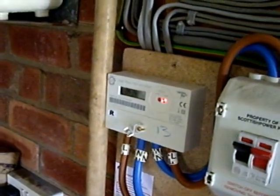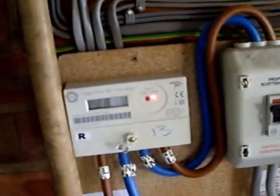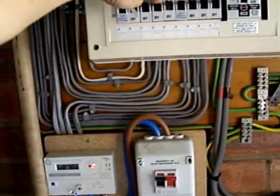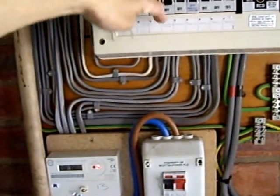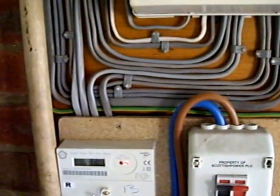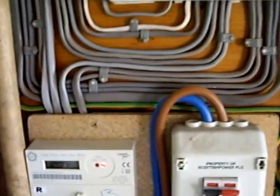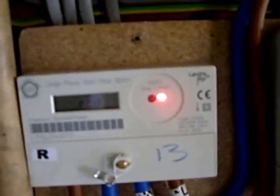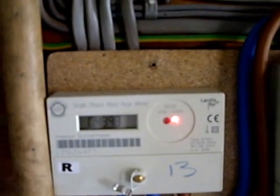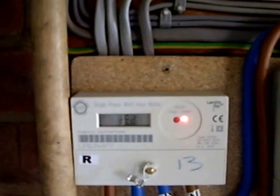Now the real trick is when I do that operation — are we charged? Or is the system quick enough to respond? Because we've had a lot of debate about how these meters work. So if I repeat the test — turning off the immersion — we're clearly still exporting, and I can see the blue light is on, so the control system is maxed out. If I turn on the immersion again and watch what happens at the meter — we've stopped exporting. We got one flick. I don't think I've seen that flick before. So we've been charged one watt hour's worth in that experiment.